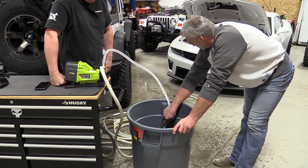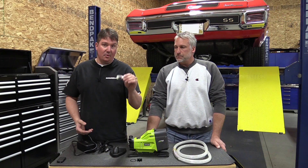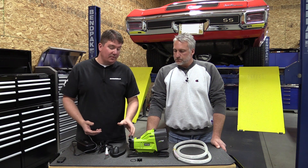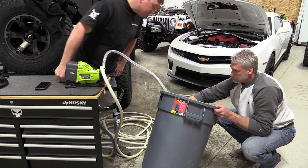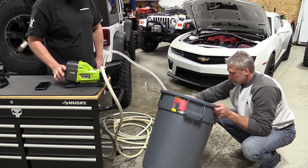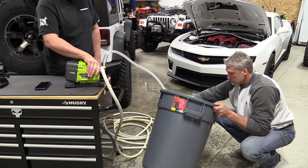The big thing is to follow the instructions. It comes with some oil — put two drops in before and after use to keep the impeller lubricated as it spins. You also have to prime it; it's not self-priming. But it primed very easily — a little water in the hose and it took right off.